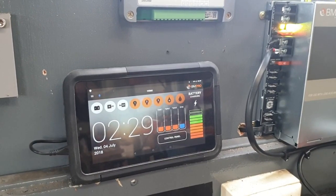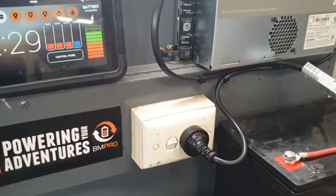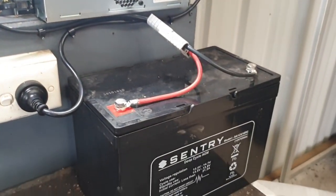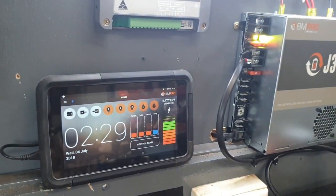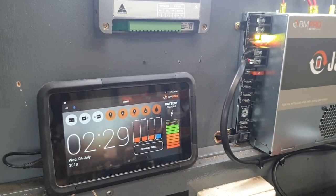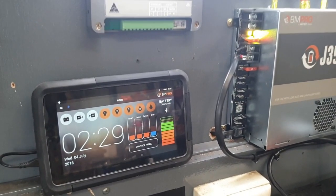The way this is set up is that it will work whether it is on AC power — which is actually what we're on at the moment because we're charging our battery — or whether we're just on battery power alone. The way it works is it will disconnect all loads except for the power to the tablet, to prevent that drain on the battery. In the background though, the battery will still continue to charge.